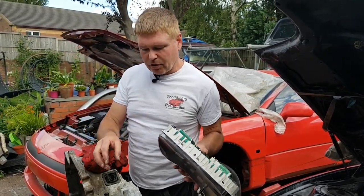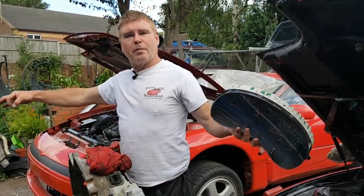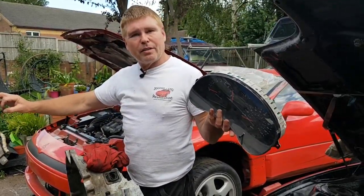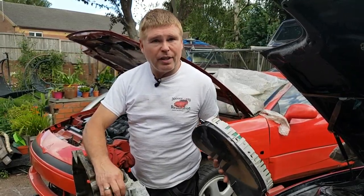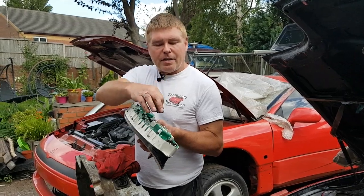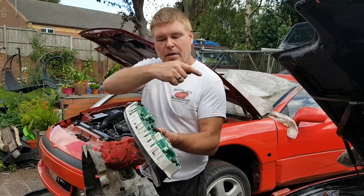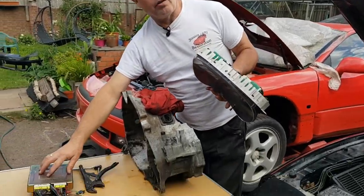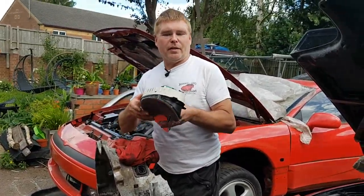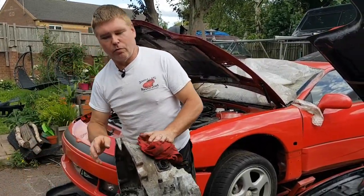If I were you I would start with the mechanical cable — it's the easiest thing to remove. Just pull the center piece out and check there are no breaks in it. If there are no breaks, move on to this and check the nylon wheel. If it's not the nylon wheel, then you're pretty much only left with the display itself. After the display makes electronic pulses, the pulse then goes down to your ECU where it's used for other things. So that's the most basic version of your speed recording equipment.